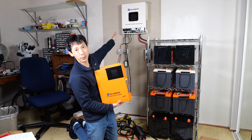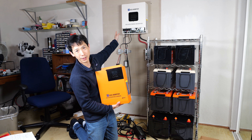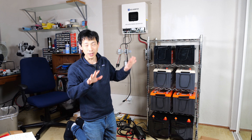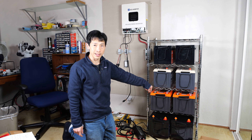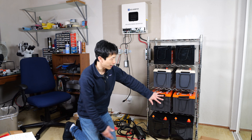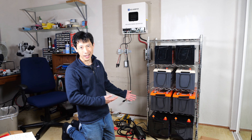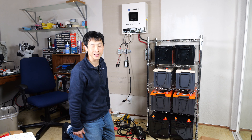So now I've upgraded to this hardy board I got from Home Depot — it only costs about $15. The new one over here is also an eco-worthy, 5 kilowatts, capable of being put in parallel. Each one of these is a 12 volt, 200 amp hour battery, giving a total of 20 kilowatt hour capacity. I thought I'd show you guys before I finish everything and it looks nice and neat.